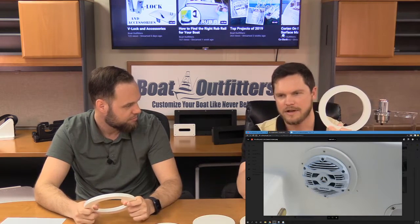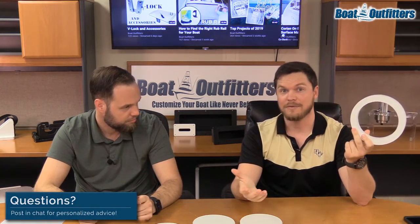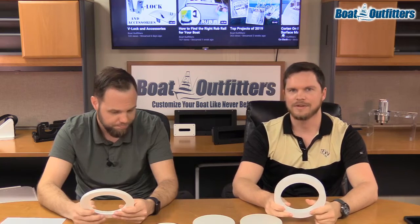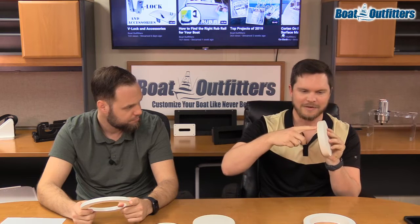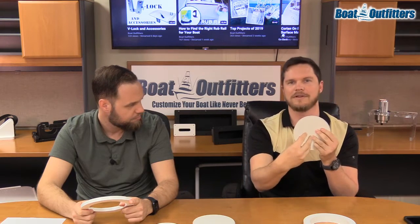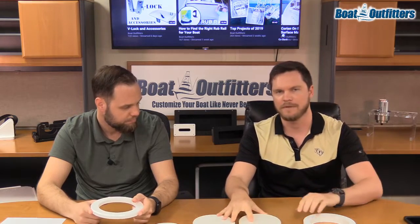I would say yes and no to that. Starboard is much easier to work with on the user end, but we do offer acrylic drill bits, so when you go to make your mounting holes, that's true. You do have to tap into the acrylic, and it's brittle. It'll break if you try to use a regular drill bit. A lot of times, as you start to drill through acrylic, you'll go in just fine, and as you get to the end, about to punch through, that drill bit's going to bite and blow out the acrylic on the backside. In small pieces like this, it can be catastrophic for the part.